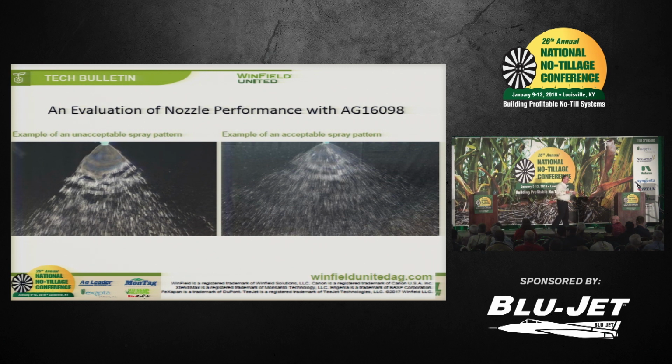If you don't have a good wide pattern, what happens to your weed control? It's a problem. So we've had to learn over time that we need to raise that pressure to get that pattern back where it needs to be. And this happens to be a little trial that Winfield United did last year with one of their DRAs that was approved for the dicamba process, which now has an official name, I believe it's called On Target. But they showed through picture evidence that yes, there were products on the dicamba approval list at low pressure recommendations that weren't meeting the standard for a good application.